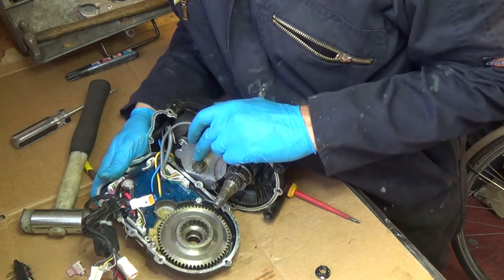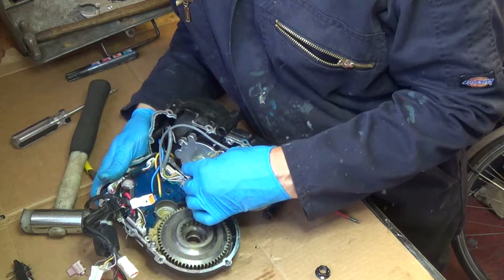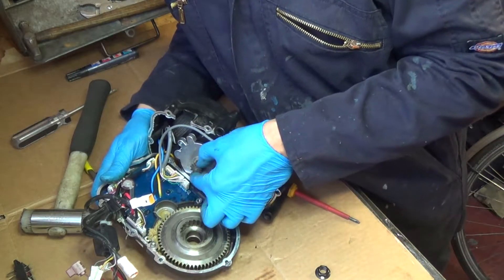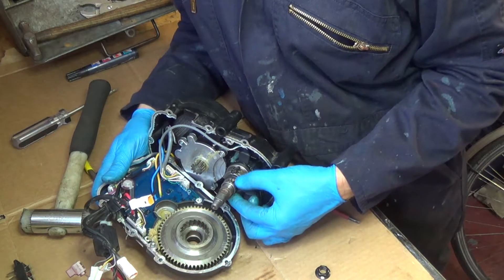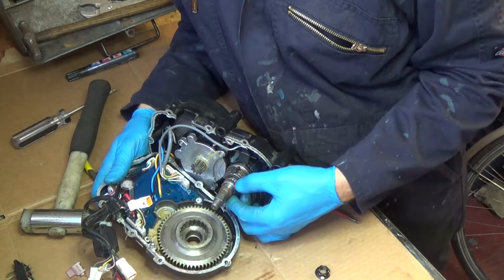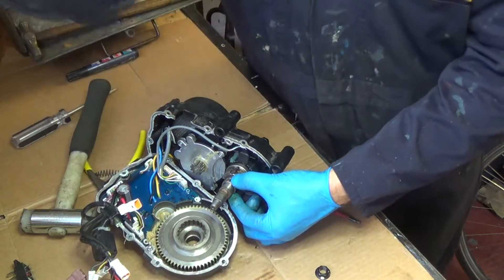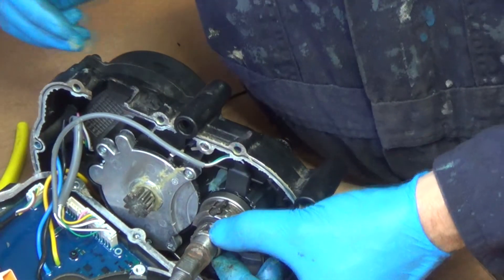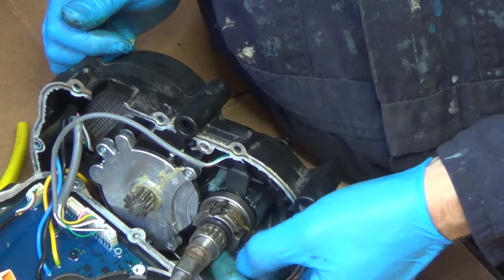This is the drive from the motor — that's got some kind of ratchet on it as well, but I can't feel too much play in that; I think that's not too bad. Where there is play is in this one — it's like a spindle, a needle bearing. I can feel play on that on the shaft. I know it's only a needle bearing but I wonder if that might be worth replacing.